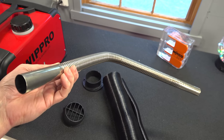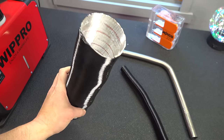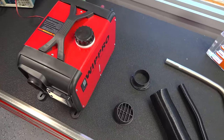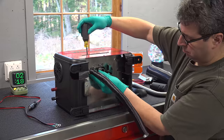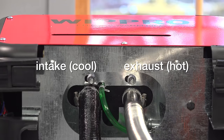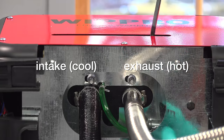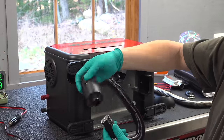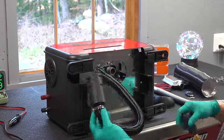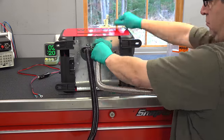Almost all models will include a stainless steel exhaust pipe along with a heat delivery tube — essentially like dryer hose, except made of metal. The heat that comes out can be almost 400 degrees at the outlet. Most models have two outlets on the bottom: one for the intake air that goes into the chamber to drive the combustion process — that hose remains completely cool — and the other for exhaust. There's also a sound intake muffler box with a small screen to keep out bugs and other pests.